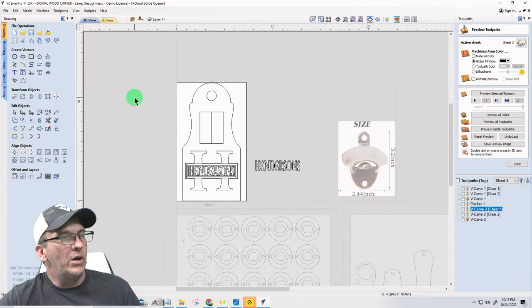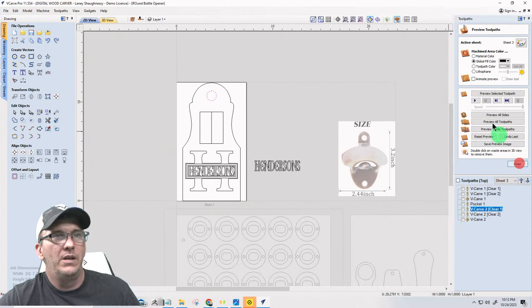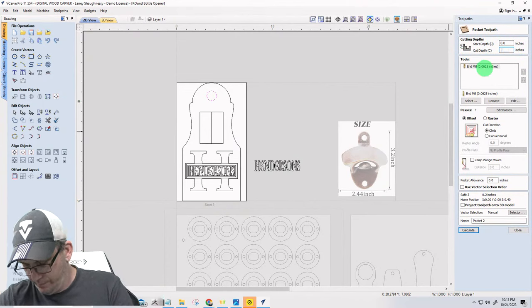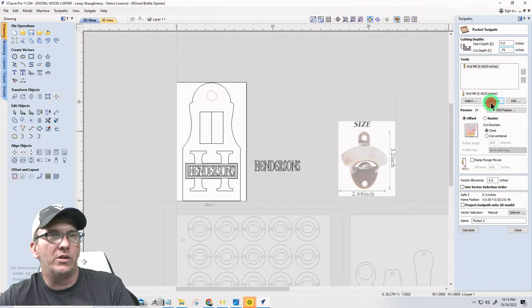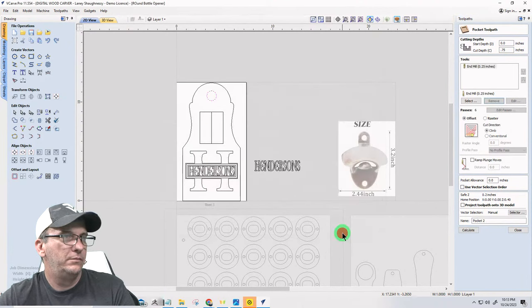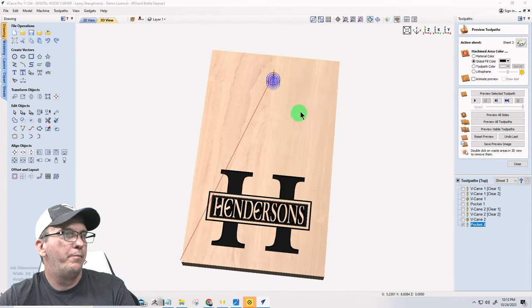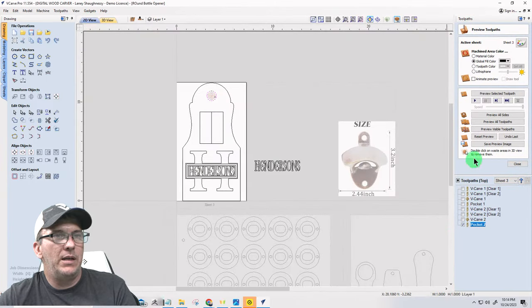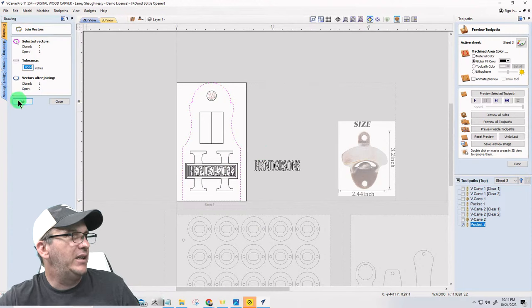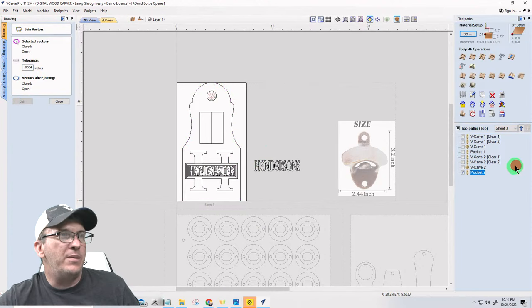All right. So the toolpaths, I've got the front toolpaths. We have a through hole, so a pocket cut going all the way through the material, 0.75. We're going to use a 1/4 inch end mill. And then a profile cut. Got to join all of these. Now these, just because I drew them a certain way, I remember I cut them over here to flip, so I got to rejoin it back into one closed vector. We're going to do a profile toolpath.